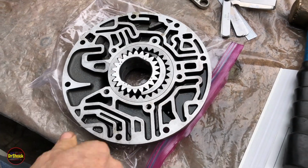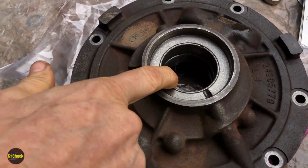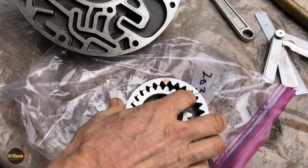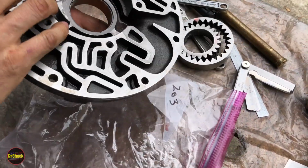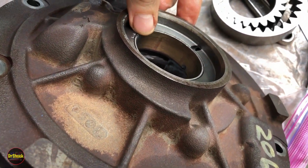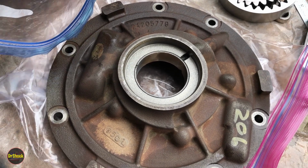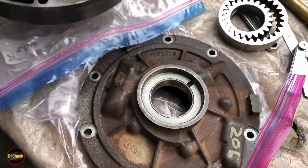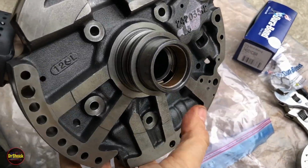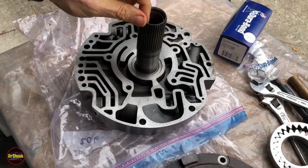Well, before we can start assembling the pump, we've got 2 more final bushings. We got one here. These over here. So we got one here that's pretty easy to push out. We'll just push it out from the front here. And we can see that he's mounted flush. Then on the stator side, we've got this little guy right here. We got to get out. And then we got a guy right there. So we've got 3 more of these bushings.